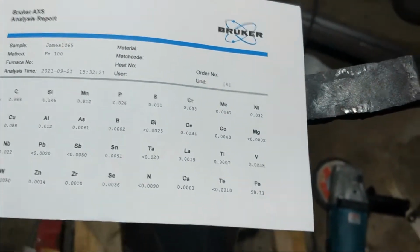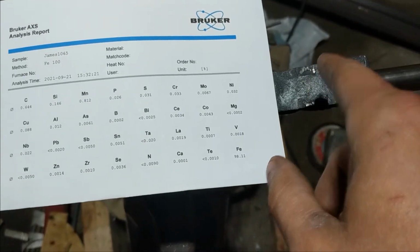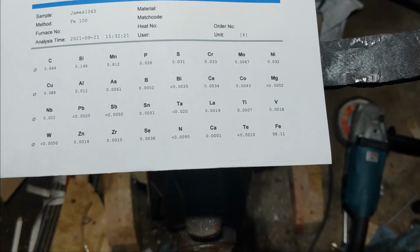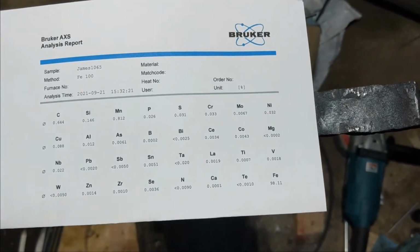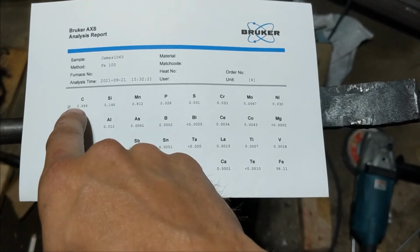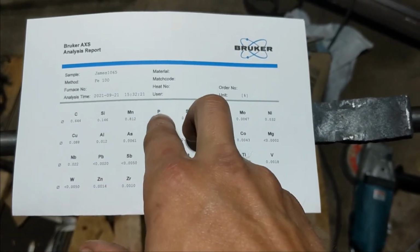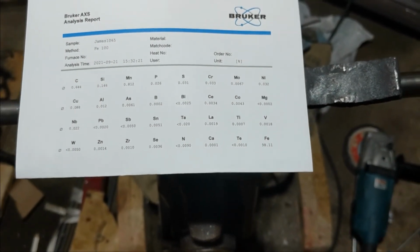In case you didn't know, in the realm of carbon steel identity, I called this 1065 steel. The 65 means that it is 0.65% carbon, and the 10 refers to a plain carbon steel. If you look up online some data tables on the composition of 1065 steel, you will find that carbon is generally between 0.63% and 0.67%, and manganese similarly is between around 0.7 to 0.85%, and there's also sulfur and phosphorus in it. So dead ringer. This is 1065.